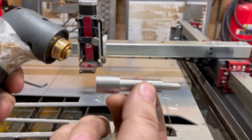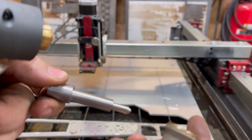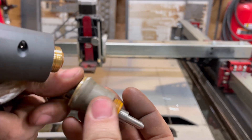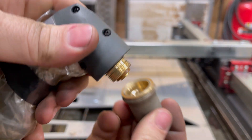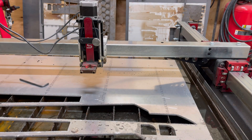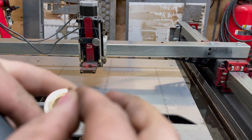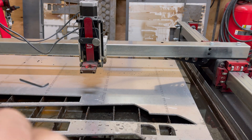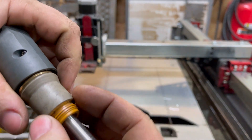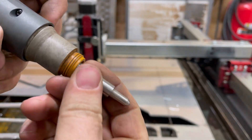I machined it down so this part can slide through the ceramic bit, and then I had to bring the shoulder back to here so that this guy can thread down into it. But I took the shoulder back a little bit too far because there was some slop. So I just found some awesome custom United States spacers — dropped them in. Good old 20-cent mod. Tighten it on until there's no play. Seems to work pretty good.